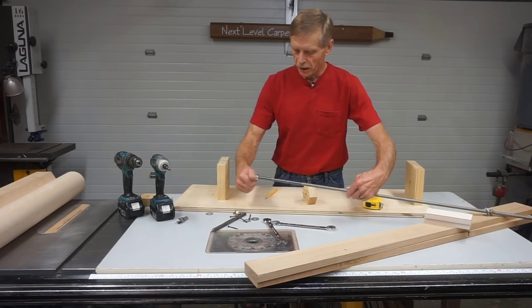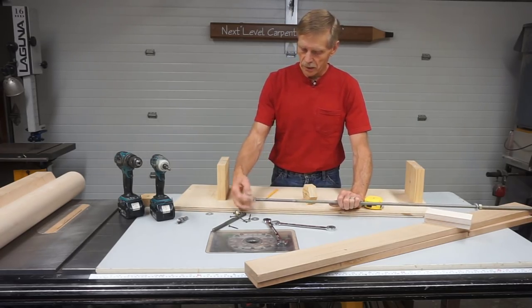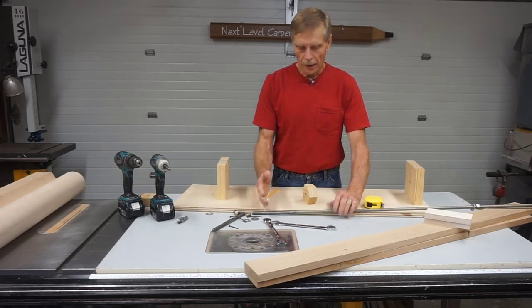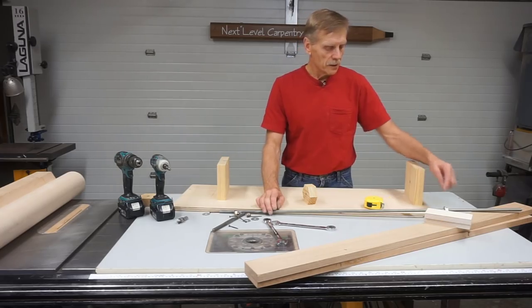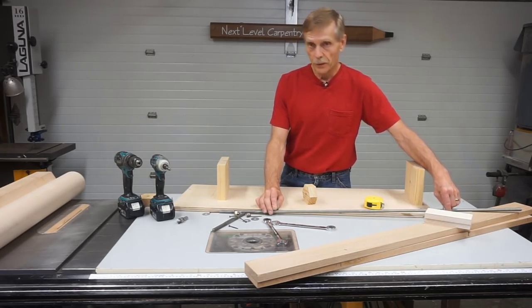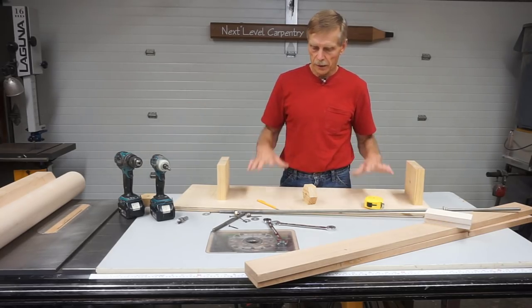I use regular half inch nuts on this rod. If I was going into production making a bunch of these, I would incorporate Nylock nuts on here so that things didn't move around. In this limited production case, I just use a piece of masking tape to hold the nuts in place once they're snugged down. You'll see how that looks when I mount the blank into this lathe.